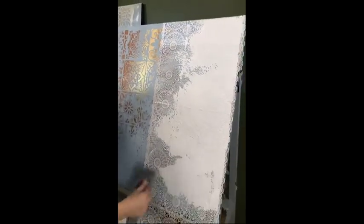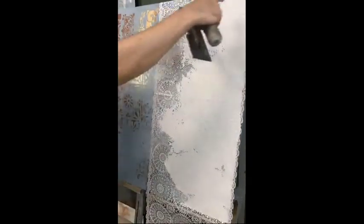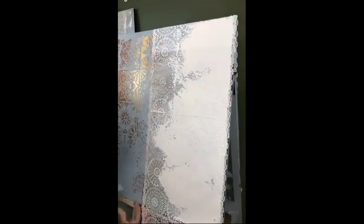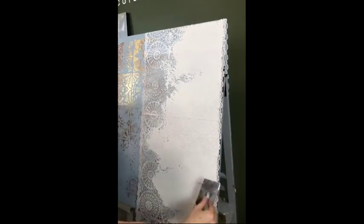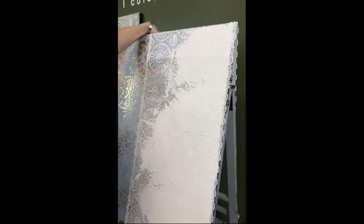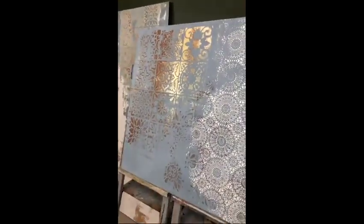Here we resume with the off-white calce cruda. In this case, we always start from the edge with quite full coverage, becoming progressively lighter toward the center, to demonstrate a wall that has deteriorated over time. This is the latest application of off-white calce cruda, and the way Areld deposits the product is very interesting — leaving more product at the edge, then moving toward the center of the wall.